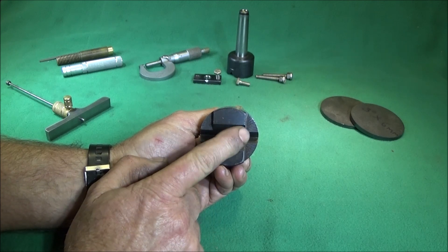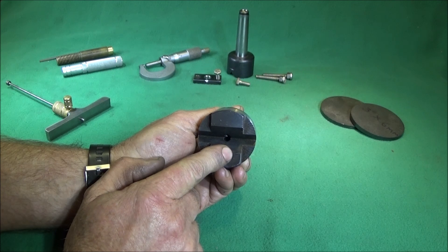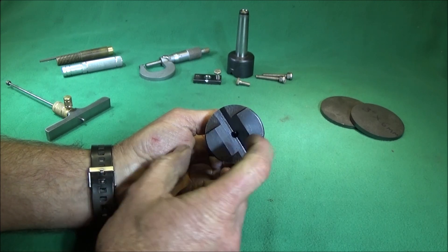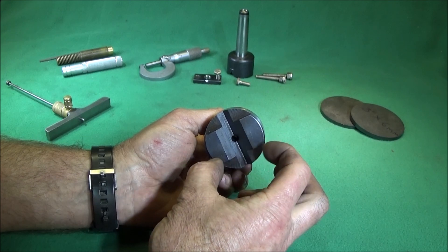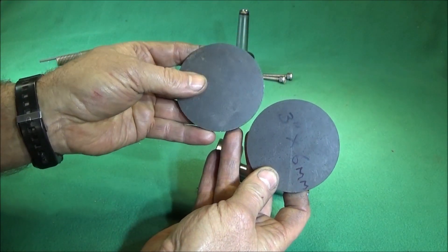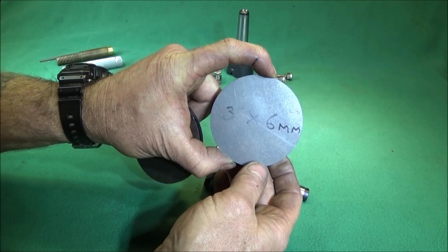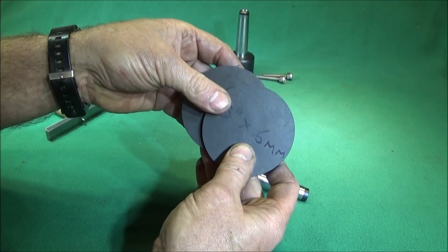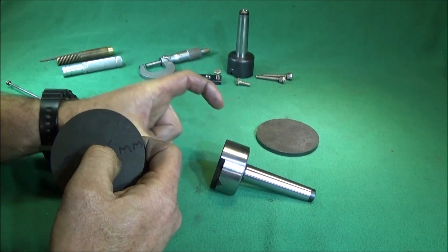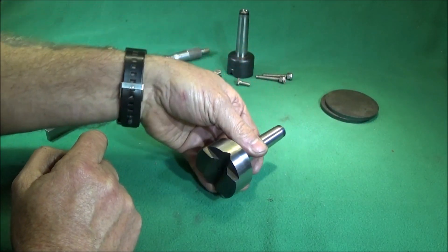It would be awkward if you were drilling and tapping because you'd have to try and line it all up again for the tap. So what I've decided to do is make a clamp to fit this one. I'm not going to drill the face on it because that will limit the size of bar. I've bought these two nice pieces of laser cut mild steel — they're nice and flat so they won't need to be faced off. They're three inches in diameter and six millimeters thick. I'm going to make a clamp that locates on the back of the adapter and clamps down on the front.